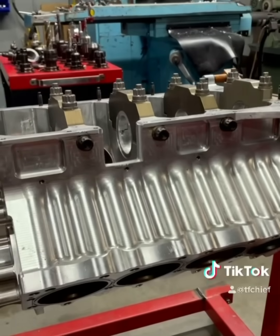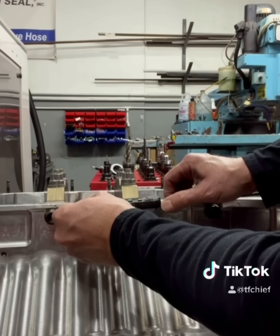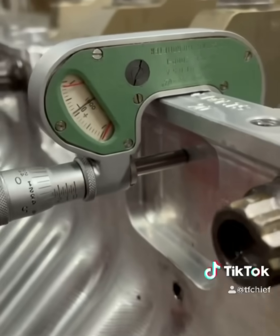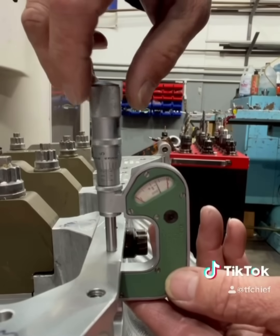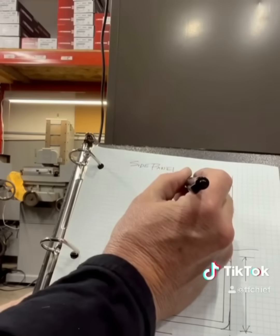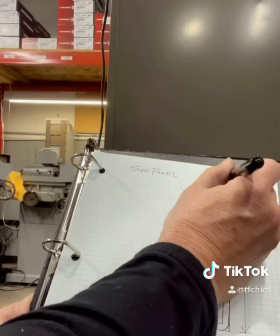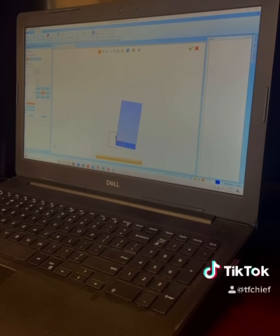Just to give you an idea of how big this hole is in the side of this block — now I'm just taking some measurements on the width, the height, making sure it's square, the thickness of the panel itself, and how thick the pan rail is going to be. I don't know if you guys ever used a micrometer like this with a pressure gauge on it, but you need to get one. So I just took all the dimensions and made a little sketch, just kind of filled in the blanks.